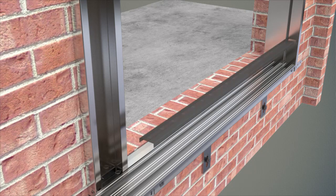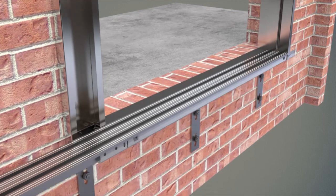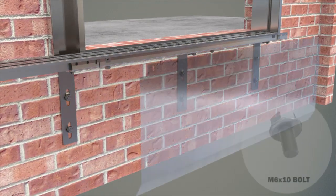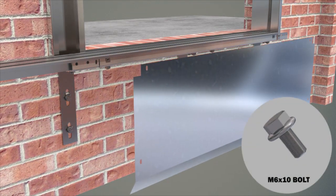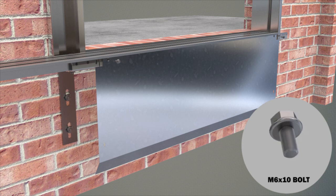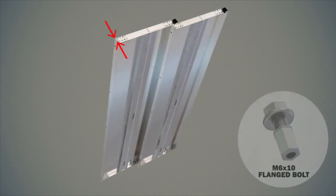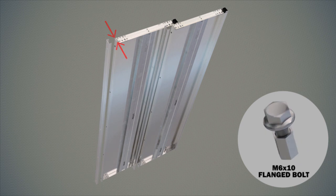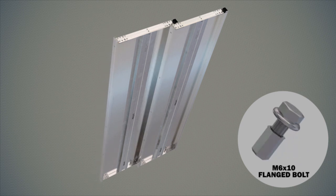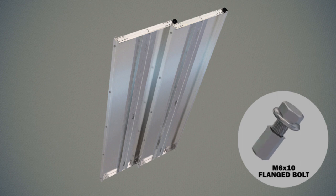U-form sill gator molding is placed onto the sill plate to fill the sill plate lower rail gap. The lift landing door bottom plate is connected to sill plate by two washer head and hexagon head metric 6 x 10 bolts. To complete fire molding assembly, the fire molding in the package is connected onto metric 6 rivet nuts located at the narrow side of the panels by metric 6 x 10 hexagon head flange bolt.